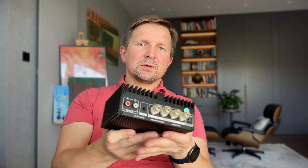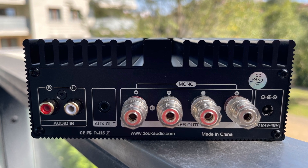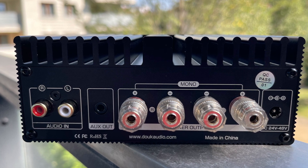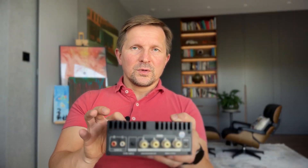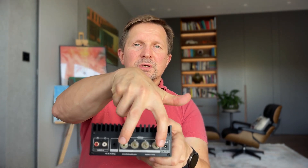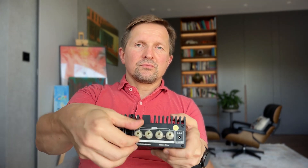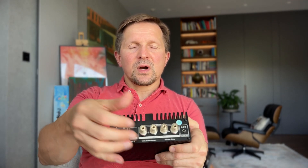In flat or full-frequency mode, two other knobs become operational: one is the general volume control and the other controls the volume for the auxiliary out. This amp also has a 3.5mm auxiliary out, so if you use it in stereo mode with two speakers connected, you can add an active subwoofer and use the aux out volume knob to control it. If you want to use it as a monoblock, you just use two of the binding posts, which are pretty nice and accept banana plugs, spades, and bare wires.